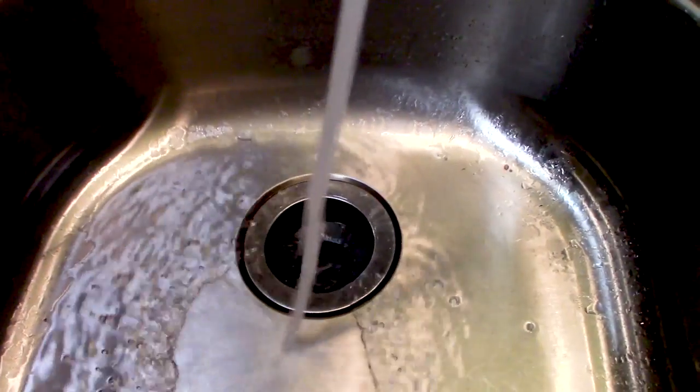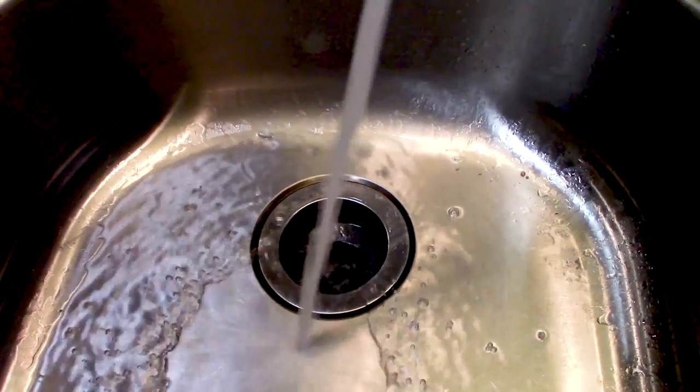The bleach water has been sitting inside my freshwater tank for about three hours. Now I'm going to run that bleach water up through all my lines and all my faucets to make sure those lines are also disinfected. When that's done, I can dump the dirty bleach water out through my gray tank into the sewer line. Because I have access to the water, I'm going to fill up the freshwater tank two or three more times, run it through the lines, and dump it until I don't smell bleach.